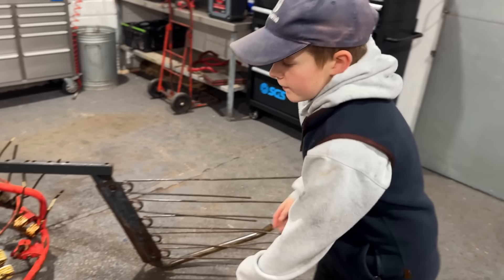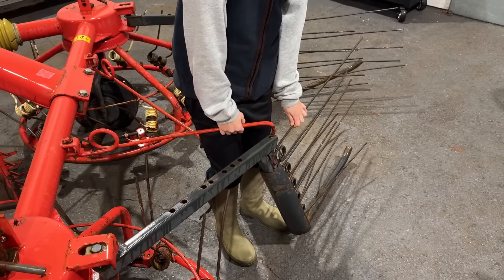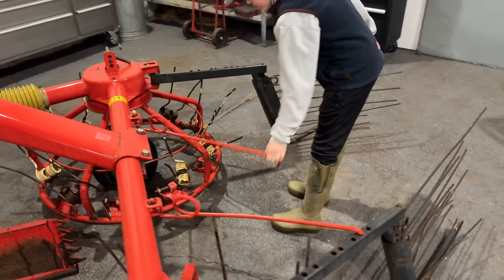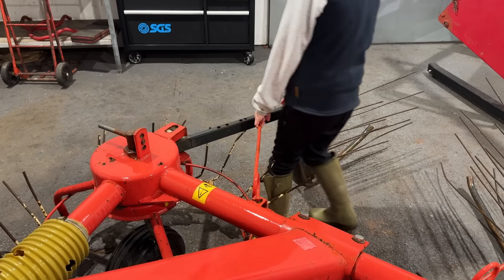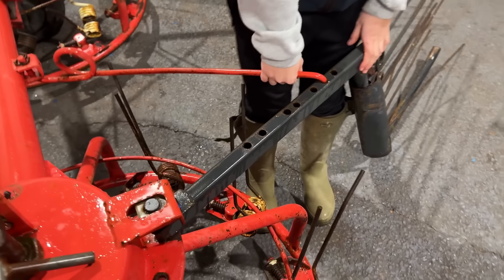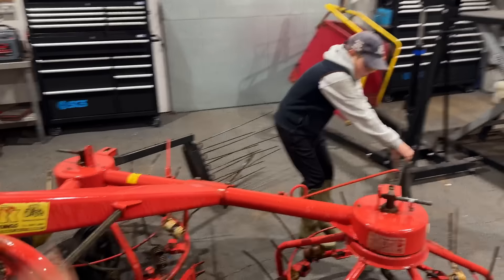You've got your gates - they fold back out around. If you pull them in tight you've got it for rowing up. Come back out to probably the middle hole for rowing up - do the same on the other side. So that's your rowing up position, which puts everything into a row. Then you can put the gates right out onto the wide position, or some people take the gates completely off for tedding, which allows you to spread the grass out the back.